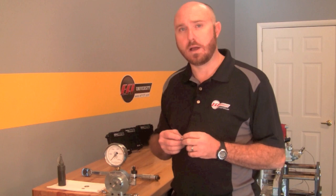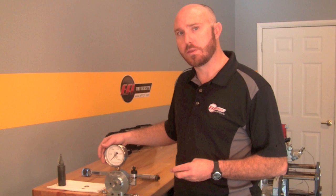If the rod bolt cannot withstand that force, it stretches too far and won't return to its original shape. So if we stretch the bolt too far we lose the clamp force that we actually need. The Skidmore-Wilhelm bolt force tension gauge is how we determine that.